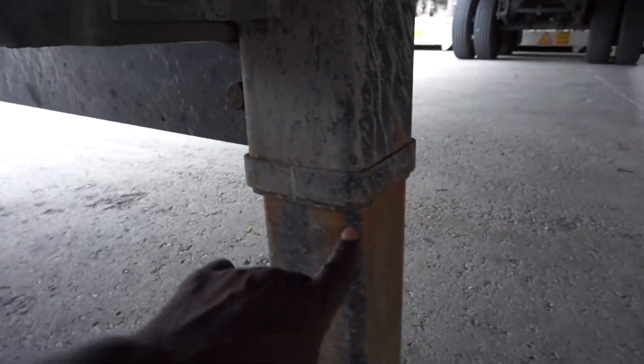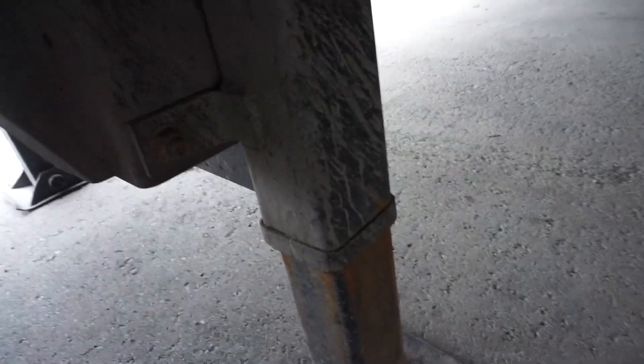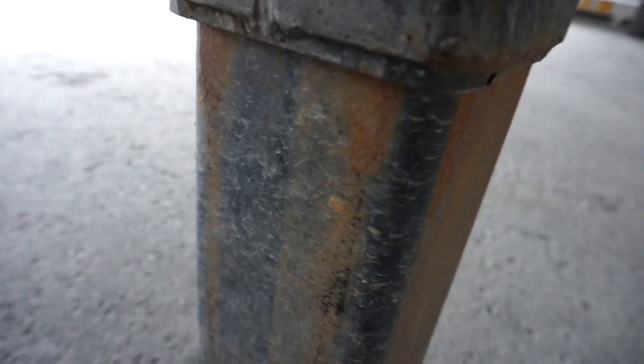Since this right here is working, let me try to see if these two lines right here go up guys, and then I'm gonna see if I can get it. Remember, I can't pull it out cause it's too close to this one. I gotta get my airline — emergency line gotta be tightened up. But anyway, I heard my air dryer go off so it means I ain't lost that much air pressure. Watch the double lines — it should be moving up right there, you see it? It should be going up.